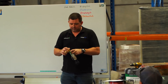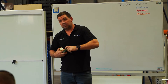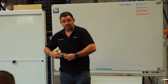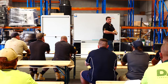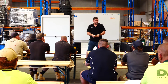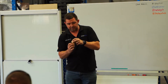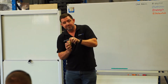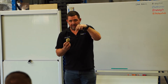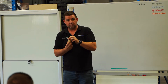If you're not sure about backflow requirements, most of the information is available on the internet, and I've got a team of people that can help you with that. If you're doing new home packages, you might be putting tap timers on garden taps — they technically require a backflow prevention device to protect the mains. The backflow prevention devices that go on a tap are small little brass one-way spring valves. You just screw that straight onto the tap, put your tap timer on that, and it protects your drinking water supply.